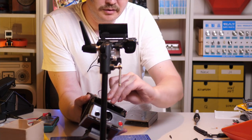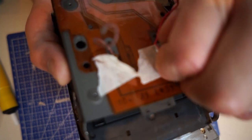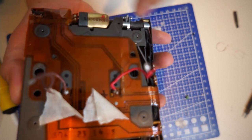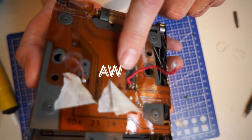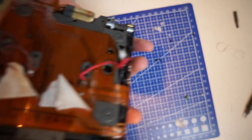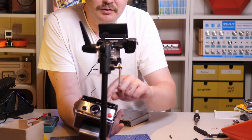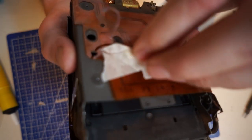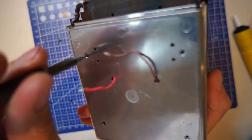What you need to do is solder from here — that's the negative, the minus — and from here the plus. The cables need to be thin but don't use too thin cables. This is about wire gauge 20. If you have thinner cables you could use double cables. Make sure they are isolated because this cover can actually conduct a little bit of electricity and drain your battery. Solder those cables here and then put some tape over to prevent short circuit. Then simply pull the wires through and put the screws back on.